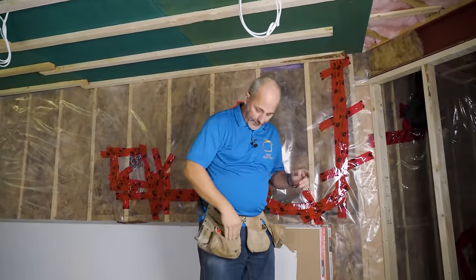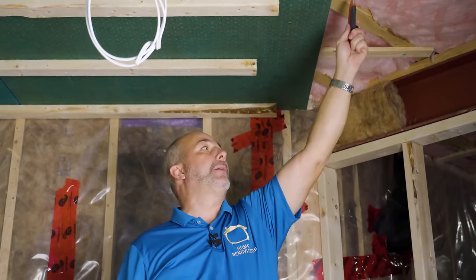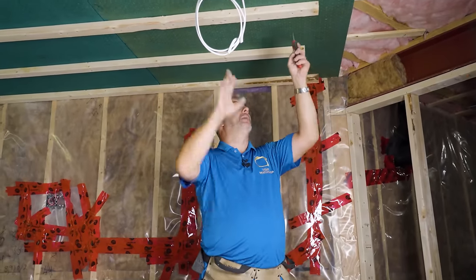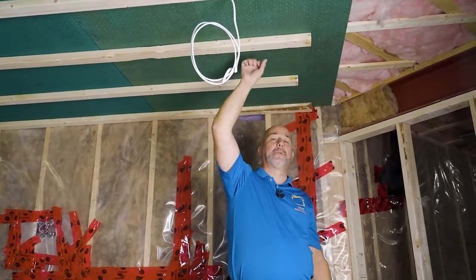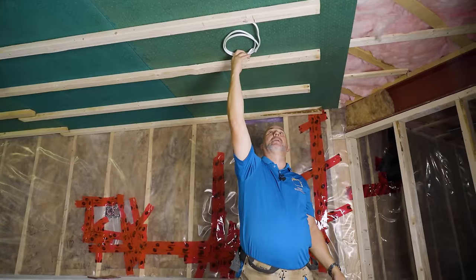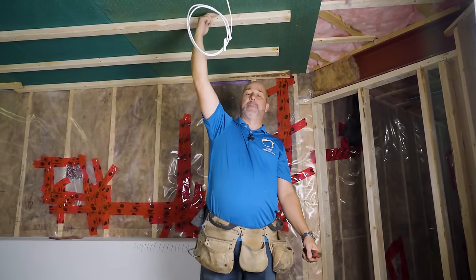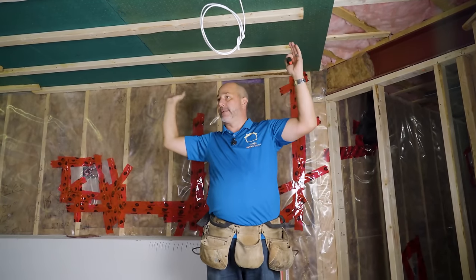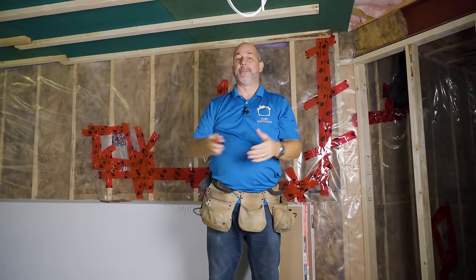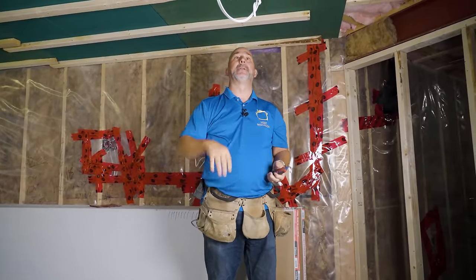Let me walk through the full assembly. In the joist cavity: two layers of R20 fiberglass pink next-gen insulation. Then a one-by-three strapping nailed to the joist, the green board screwed to the strapping with six to eight screws per four-by-eight sheet. We then strapped over top with a three-inch construction screw through a two-by-three, ran the wiring stapled to the side to code. When it's time we install drywall, drill the hole, connect the wire to the box, tuck it into the cavity. This gives the green board 100% continuity on the ceiling with zero holes.